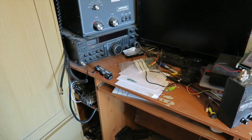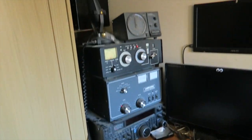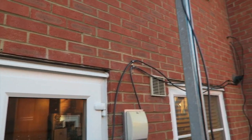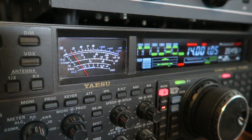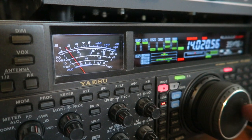Here's the problem. My radio is here and the Powerline adapter is going to be there. The coax for my antenna goes down the floor behind my desk, out of the wall, along the mast and up to the antenna. My antenna covers from 20 metres up to 6 metres, so I won't be able to test 40 metres. What I'm going to do is fire up my radio on 20 metres with the PLT devices switched off and listen to the noise level, recording at regular intervals what the noise floor actually is. Both devices are off, unplugged and not in the circuit.